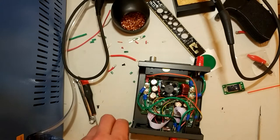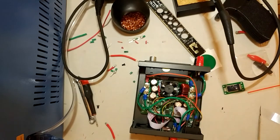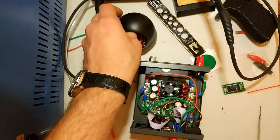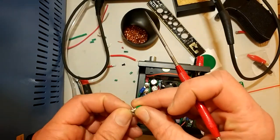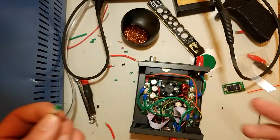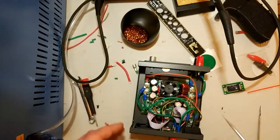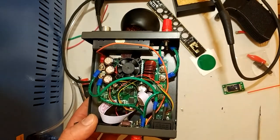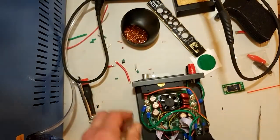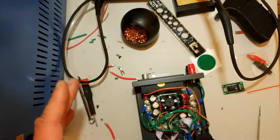Some other tips: the provided connectors also suck. I couldn't get a good crimp on them. I've got all the right tools — the nice Weller solder, the fancy copper stuff for cleaning tips, flux, crimpers with interchangeable dies — and I tried all the dies I got and I could not get a consistent crimp that wouldn't pull off two thirds of the time with a gentle tug. That might partly be because I'm using American gauge wire as opposed to the probably metric gauge wire they provide. In any case, I tossed those out and used my own ring terminals from a generic kit. They end up being better anyway — easier to put on the screw, they hold in place, and they have extra insulation to help keep you from shorting stuff out. Throw the provided connectors out, provide your own wire, provide your own connectors — you'll be much better off.